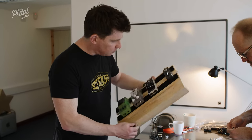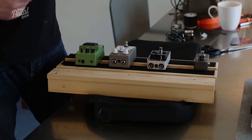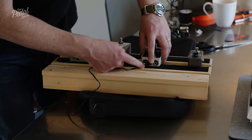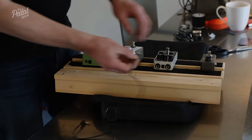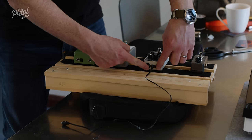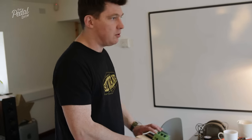Often on top mount pedals, for example, the power supply inlet will often be between the jacks. So you could potentially use a right angle one if you've got enough room to get the jack in. Sometimes, depending on how it's positioned and if there isn't enough room, it can make more sense to use the straight one because then your jacks can definitely go in beside it. But that's completely up to you how you want to do it.